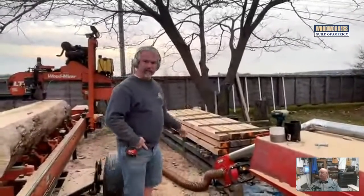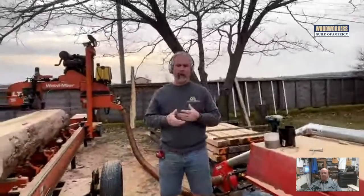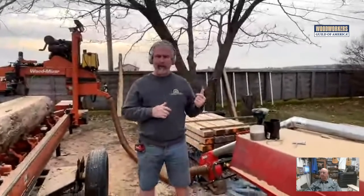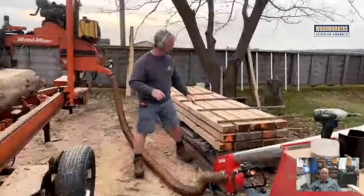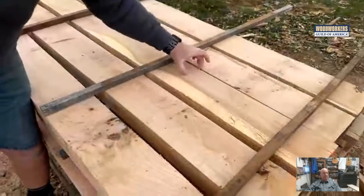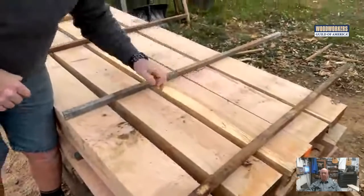That's a trick question, because that does depend on species. The log that is behind me, the lumber that's behind me, came in with a lot of punk on it, which is the deteriorating outer edge, the bark, cambium layer and the sapwood. So I know this log's been sitting around for a couple years, but once I got through that, Hayden, if you can come over here, this would have been that punk. This pail would have been that punk. I'm saving this just for the 3x3 section. But once I got through that, I was into good solid oak.